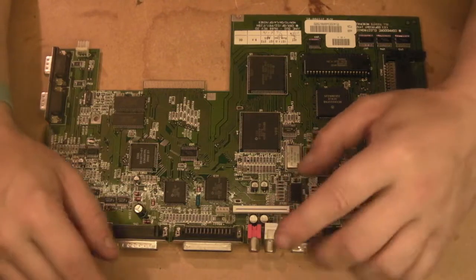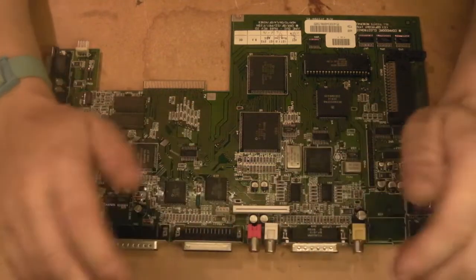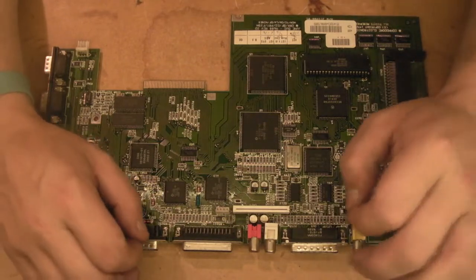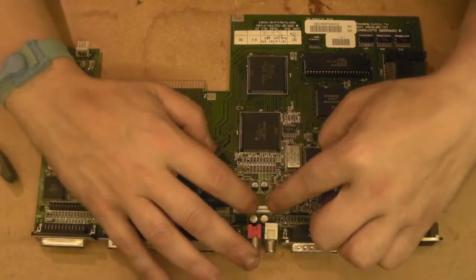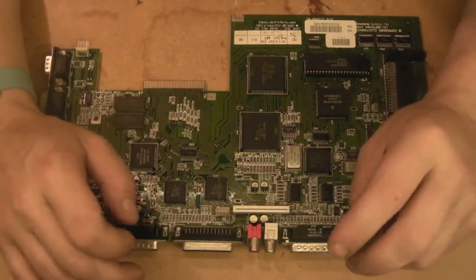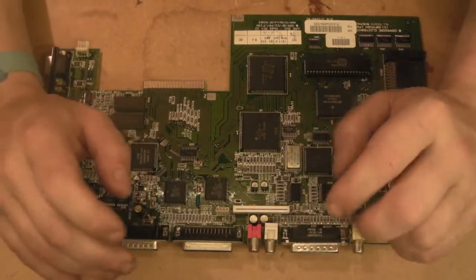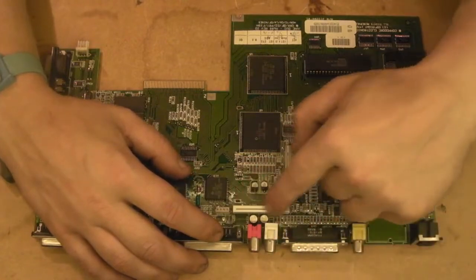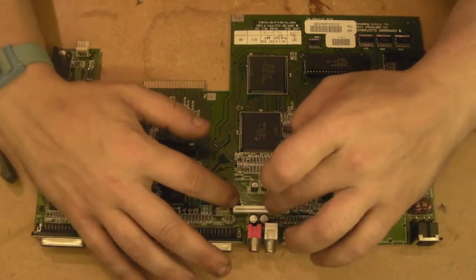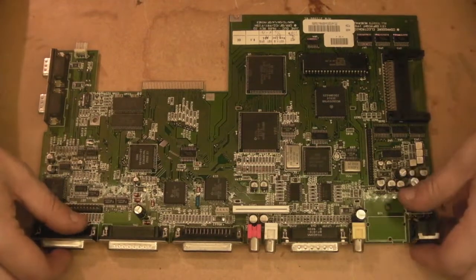It's really, like I say, unless you're going to take them off, that's the only way I can see of actually doing this really properly. I suppose technically some Kapton tape round there, some Kapton tape round there, and you could take them off with hot air and you could replace them with hot air, but I don't think you'd be able to get a really good join. I think it'd still be messy. I think the best way of doing this is to whip them off, get in there with the hot air, get them off, solder the new ones back on, and then reinstate them 2 connectors. So that's what we're going to do, basically.